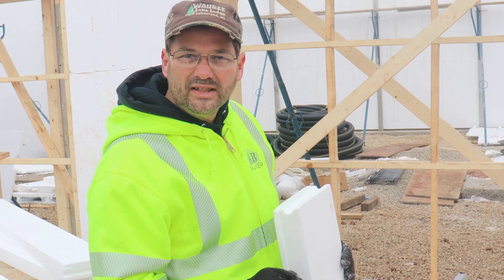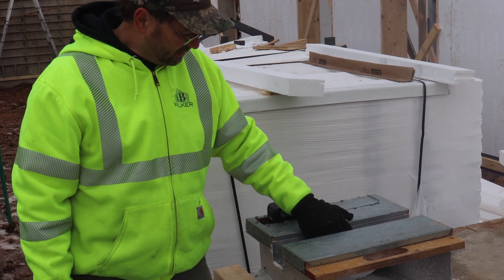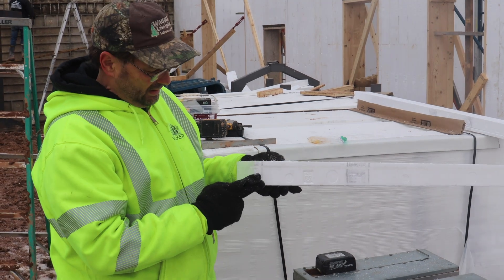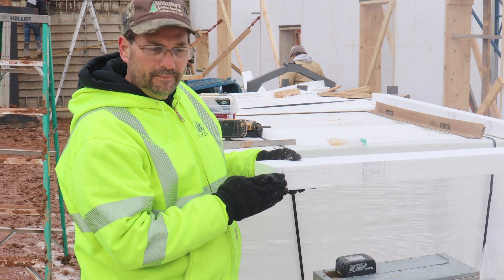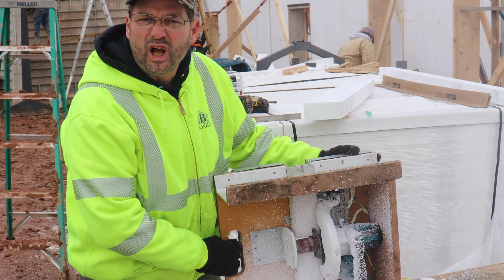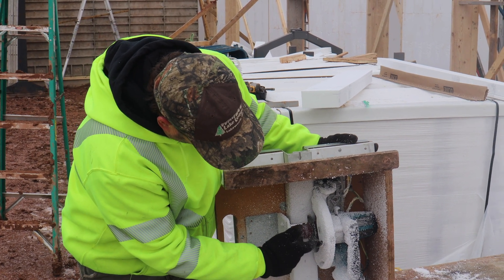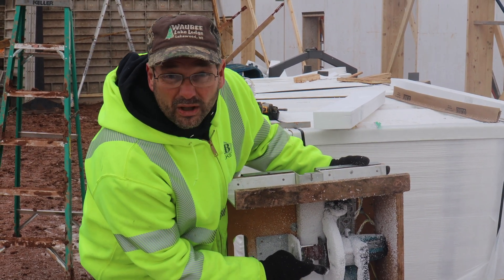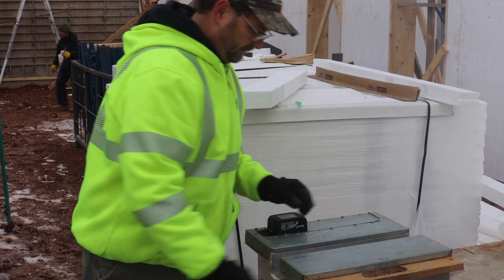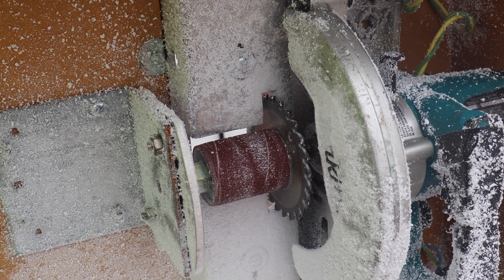The groove is actually 3/16-inch wide. There's also a custom-made saw that grooves the poly panel and sands the edge off to produce a nice custom or factory edge — that little edge sanded off accommodates the thickness of the plastic that sits against it. I used a cordless Makita saw and had a custom shaft made for $75. I added two small saw blades and a rubber sanding disc to that shaft, then made a small channel to run it in. For a professional doing this repeatedly, it really saves a lot of time.